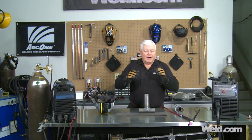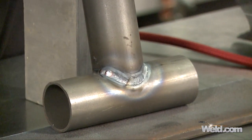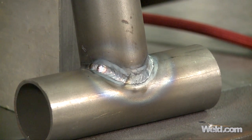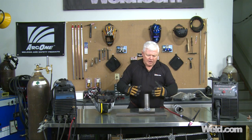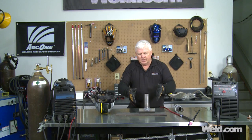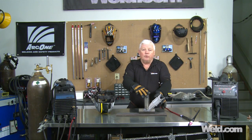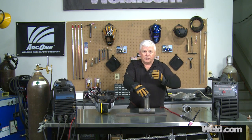Now that we've finished the weld — that was a root pass only — and because this is 125 thousandths wall thickness, I always recommend going with a root pass TIG. Now if you want to fill it with some other process — MIG or stick — to get a nice fillet in there, that's fine. Or you can do a second pass with TIG. Obviously I prefer TIG for both root pass and fill pass. For the fill pass, you may want to go a little larger diameter filler material. This is a series we're going to be doing on fabrication — this is one of the first ones — showing you a saddle-type configuration. We're going to continue, get a little more difficult, and show you how to do 45s, 60s, and odd shapes. As our projects come to us, we're going to share them with you.